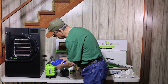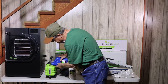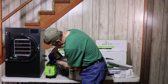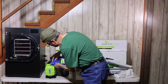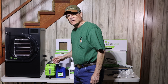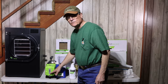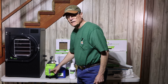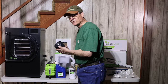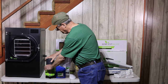It does take most of the bottle but not all of it. When you start getting a good bit of the bottle in, watch your sight glass carefully — when you start seeing oil in the sight glass it comes up kind of quick, so go slowly to make sure you don't overfill it. Then take your filter filler cap and demister filter and screw it back on, just snug it up.